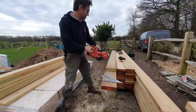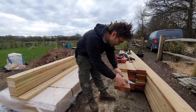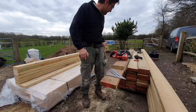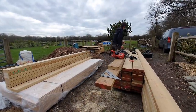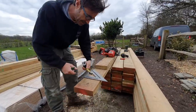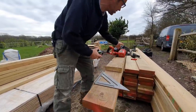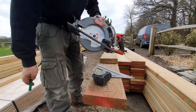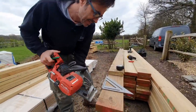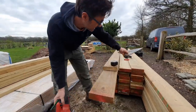I'll keep that speed square where it was and make a line here. Now that measurement is important to me, because I can create a very quick repeat cut template. That's 35 millimeters — that's from the edge of the blade to the side of the base where I was pushing it against that speed square. So I know my joist length.